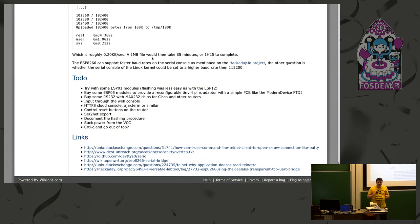One thing I wanted to do was a commercial device: take an ESP in the right form with some kind of headers that you can choose with jumpers, all the combinations possible with the pins. On OpenWRT routers you typically have four pins: VCC at 3.3V, the ground, and TX/RX. You'd have an ESP directly connected to that, and furthermore some kind of server or cloud device where you could send this, optionally encrypted, so that on the other side you could connect to the server and have a console back to your device.